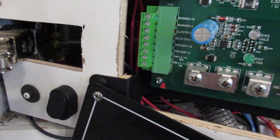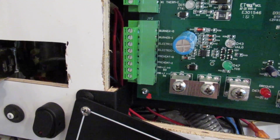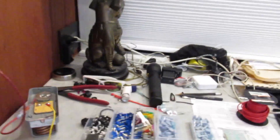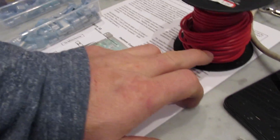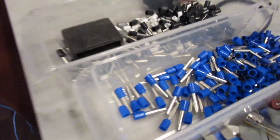We're going to start hooking up the burner — electric and preheat — starting with the bottom one. The way I'm going to do that is I'll use red for the in and black for the out, white for negative or ground, and green taped up with blue for the thermostat. Then we're going to cap them with some ferrules.